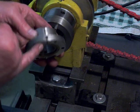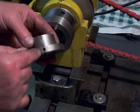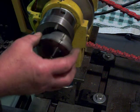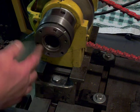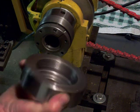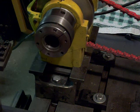One of the things that needs to be done before you start using it as a collet is where the bushing is cut right through — I drill there and thread it so that I can put a set screw in there. That set screw prevents the thing from closing when you're boring it to whatever size you need it to be. Once you've got the size that you want, you take out the set screw, and when you put the tightening ring on it allows it to squeeze and tighten on the part that you're working on.